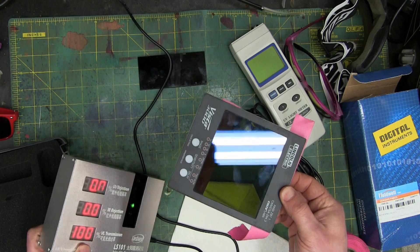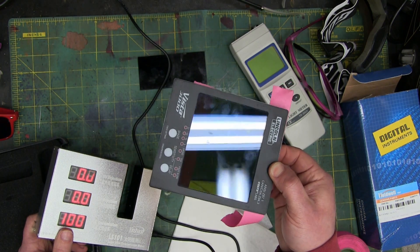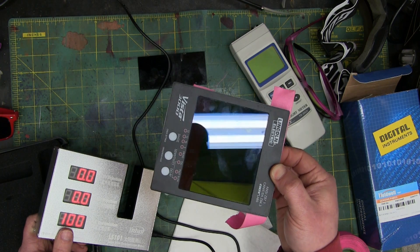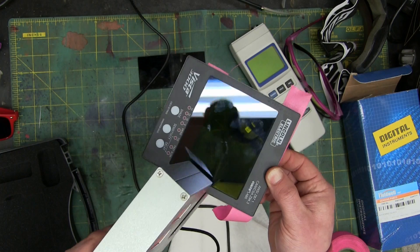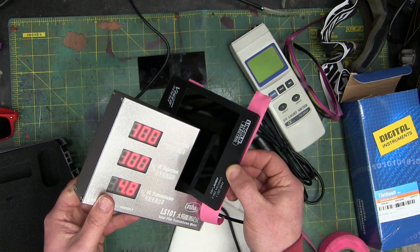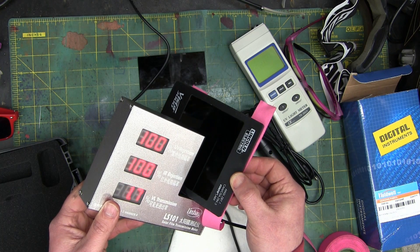That's the problem with these helmets — because they are triggered on IR, if you're grinding really hard and create a lot of heat and sparks, it's going to trigger and blind you. Kind of a pain in the ass. However, if they did a more expensive one triggered on UV, it would never do that.